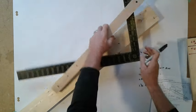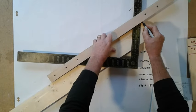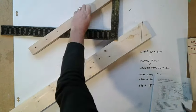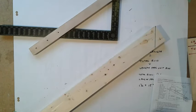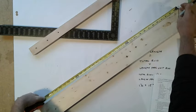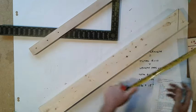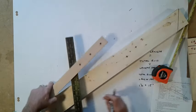Now we go straight to marking a plumb line representing the center line of our building. If we mark it right on the corner, we can hook a tape on that corner and pull the line length that we've calculated all the way down to the building line. By calculating the line length and then pulling it with the tape from one end, you eliminate the chance for compound error that you get with the step-off method.